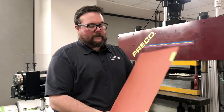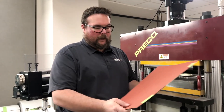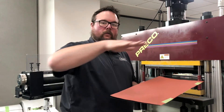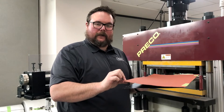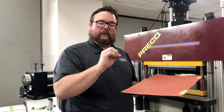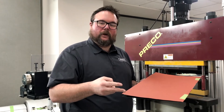We set it up on the plate and tape it so that it's hinged and we can move it back and forth. The reason we use this fish paper at 12 thousandths thick is because when we're setting up the press and we don't know where that die height is, we can come down and this will act as a safety net for us. We don't ever want the die to strike the plate — we just want to cut the material, put enough pressure on it to cause the fracture or the burst, but the blade will never actually touch the plate. That's going to increase our die life and keep the die sharper longer.